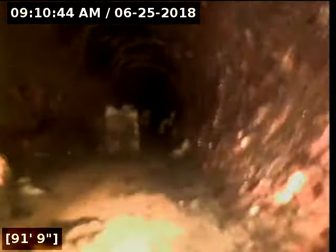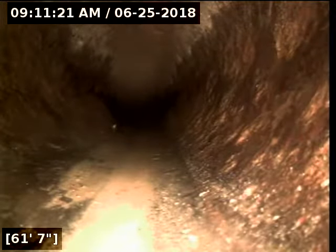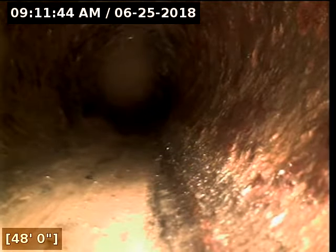You can see this stuff just really isn't moving, but it's not as bad as it has been — running the water has helped. My house was built in 1948, all this stuff is designed to last 50 years, so it's just beyond its lifespan. In Anoka it's really scary because they have a lot of what's called Orangeburg, which is this really bad pipe — it's literally like tar paper wrapped up. If you ever have someone come clean it, make them camera it at the same time, because machines can just destroy that Orangeburg. Once it gets too ovaled, we can't line it because the liner has to be round to have its strength — just like a cylinder.